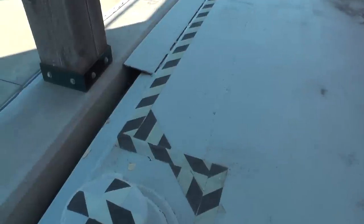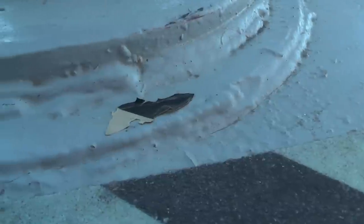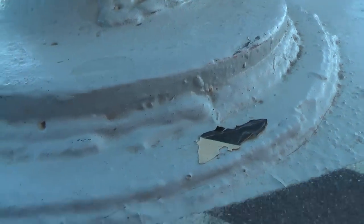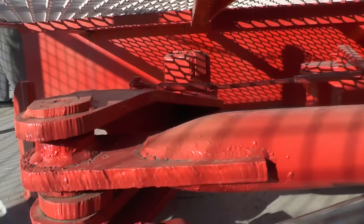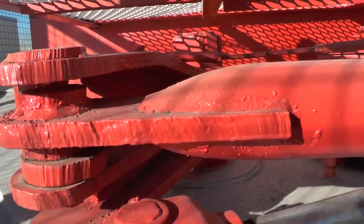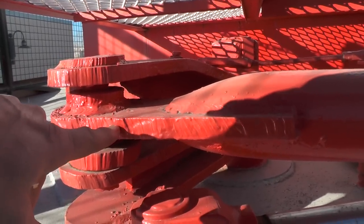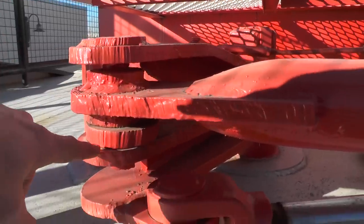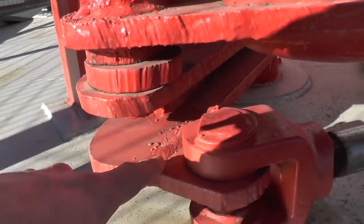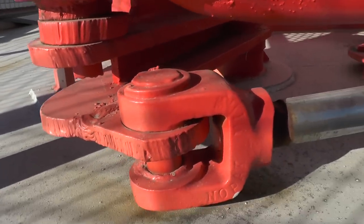So when you look at our work, I'm really happy with it. I mean, this is their welds. That's a horrible tie-in — I would have ground that flash just flat, just because I'm embarrassed by it. Here's one of their rudder setups. Looks like it's done in three-quarter-inch steel — actually I believe that's one inch, then three-quarter, with big two-inch pins. But again, the welding looks spotty to me. They don't bother cleaning up their splatter either.